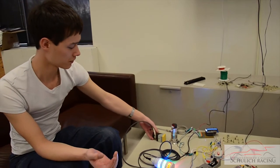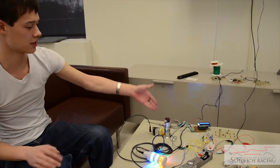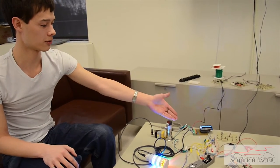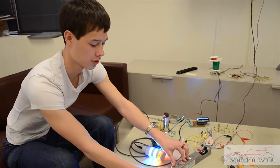To give a demonstration: the proximity sensor senses that a valve is open, ensuring there's no pressure within the autoclave. And after going through our delay circuit, we can open the door of the autoclave.